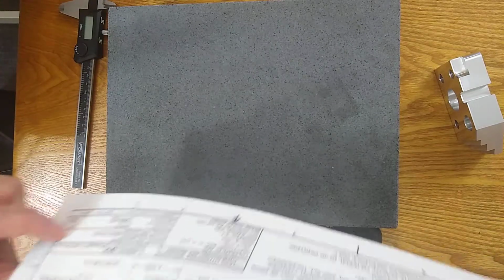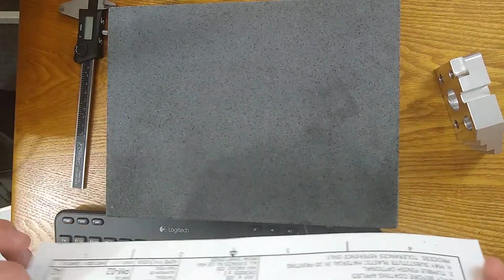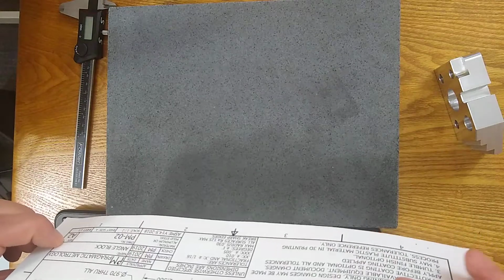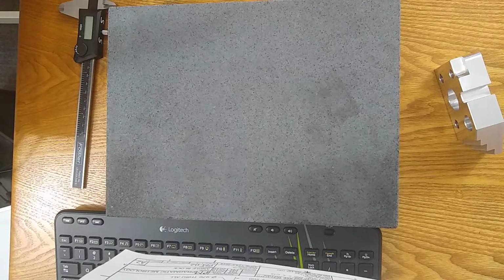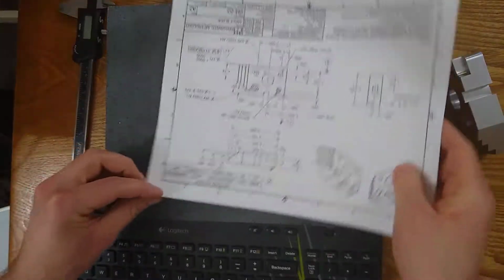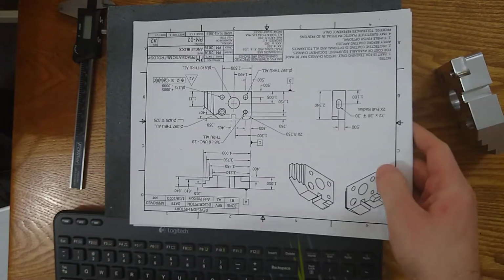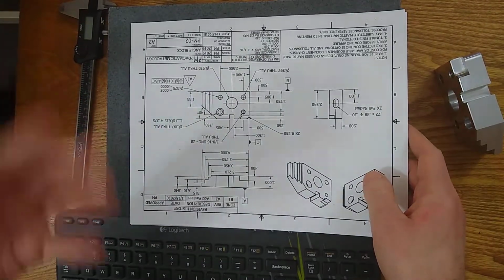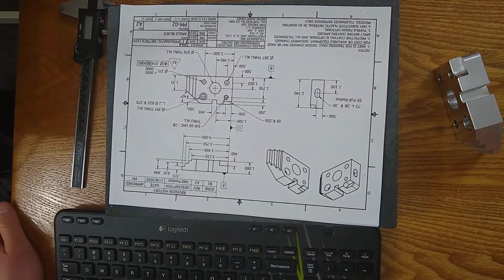You may see, if we took this example a little bit further, and 10 years from now, I'm on Rev A5 because I've added a bunch of stuff. But you're going to see A5s on here. You're going to see A4s, A3s. You'll see all of those revs. And then this block here will get bigger and bigger and bigger with each revision that I've put out. So it'll be Rev A2, Rev A3, Rev A4, and it'll just keep growing. You may go to B or C. There's different policies for revving things.